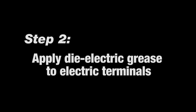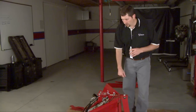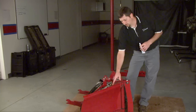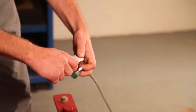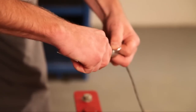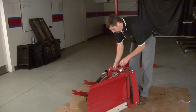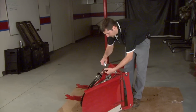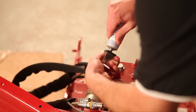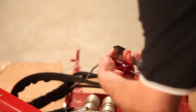Next we want to apply dielectric grease to any terminals that might be exposed to salt and moisture. We're going to start here with a V-blade. On a straight blade you won't have any electrical connections, but on a V-blade we do to control the hydraulic angle of each blade wing. Starting with the plug that goes into the tractor, just fill those terminals up with dielectric grease. Then down here on the diverter valve, unscrew that plug and fill that area up with the grease to keep those terminals from corroding.